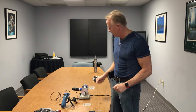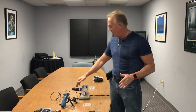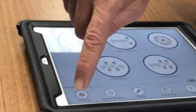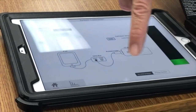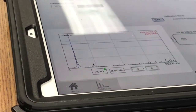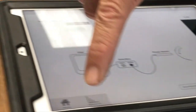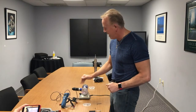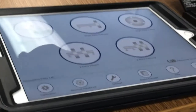One other thing with the software I like to do is make sure all my signals are coming from both my accelerometer and tachometer. I'll back out of the app and go to the home page. I'm clicking on the calibration button, turning the motor on, and looking at the accelerometer page. I open up the spectrum and can see I've got a nice spectrum — my accelerometer is putting out a signal. Now let's pull up the spectrum on the phase sensor, and I've got a nice signal there as well. So I know I'm getting a signal from my tach and from my accelerometer.